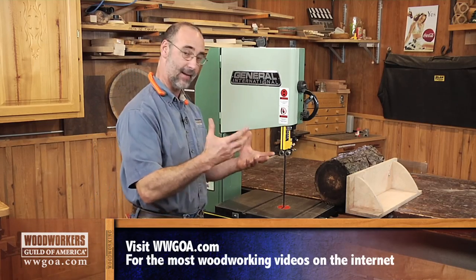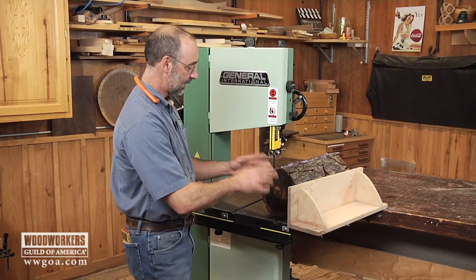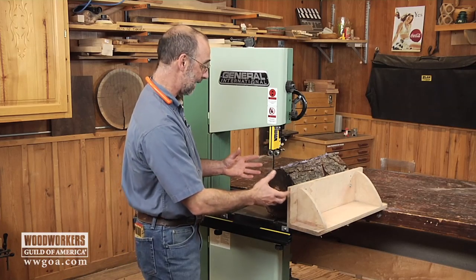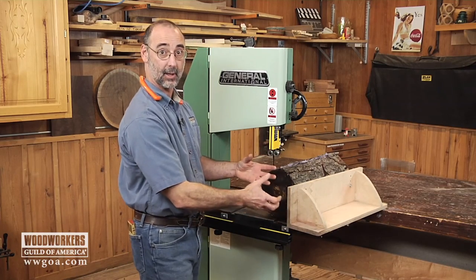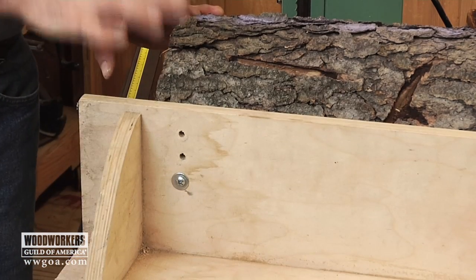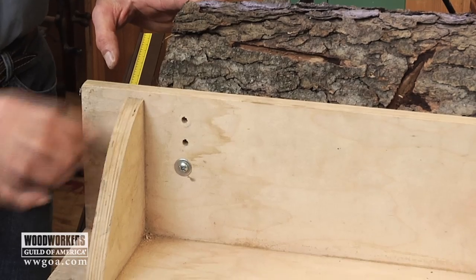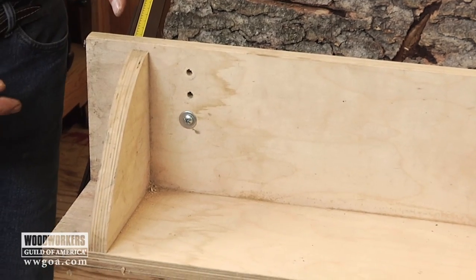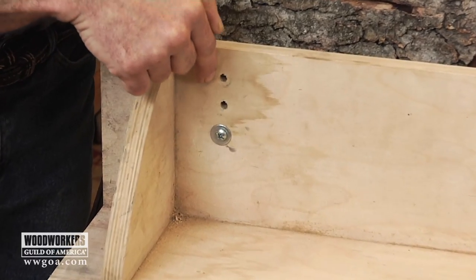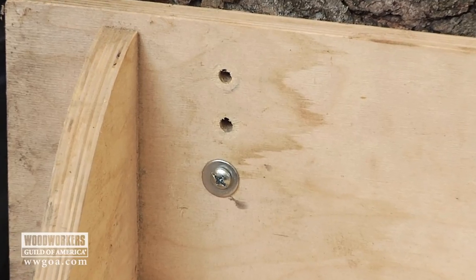On the log itself I had to do some preparation. When you cut round stock, the danger is that if it hasn't been stabilized, it's got the opportunity to roll as you're cutting it — very dangerous, very bad. So I've got this very simple sled already fastened to my log. Just a 90-degree angle with gussets that support it and keep it at 90 degrees, and there's a series of holes the screw goes into — three different holes — so I can pick the hole I need depending on the diameter of the log I'm cutting.